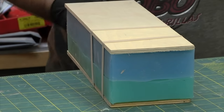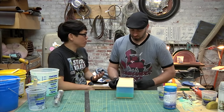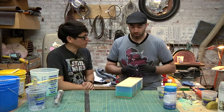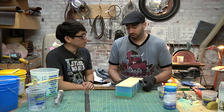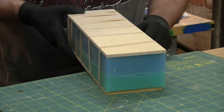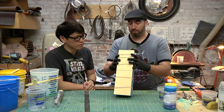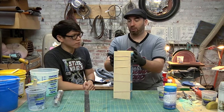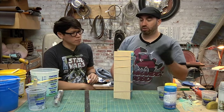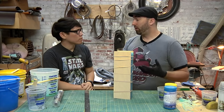So when we're talking about the proper care of a mold, like this mold using silicone, you said it lasts up to maybe 50 casts if you treat it well. If you treat it well, if you use resins that aren't going to get super hot and burn out the mold. Mm-hmm. And that means a longer setting resin, usually. These are platinum silicone, so this one will probably last longer than a tin-based silicone. Things like that can help you make a mold last longer. Using spray releases, you can use Ease Release 200 or a lot of other things just to help keep down the wear and tear on the molds.